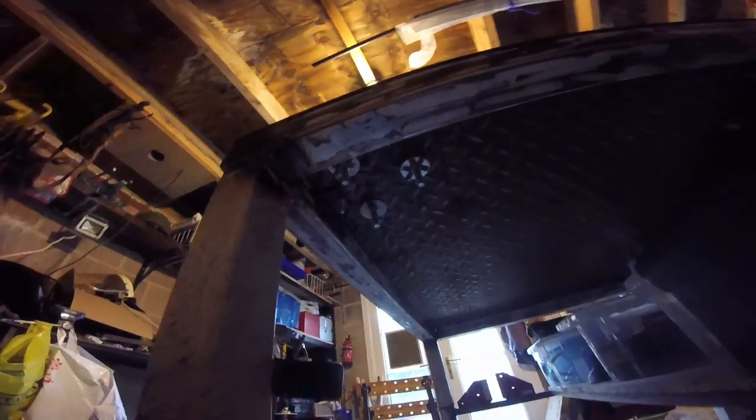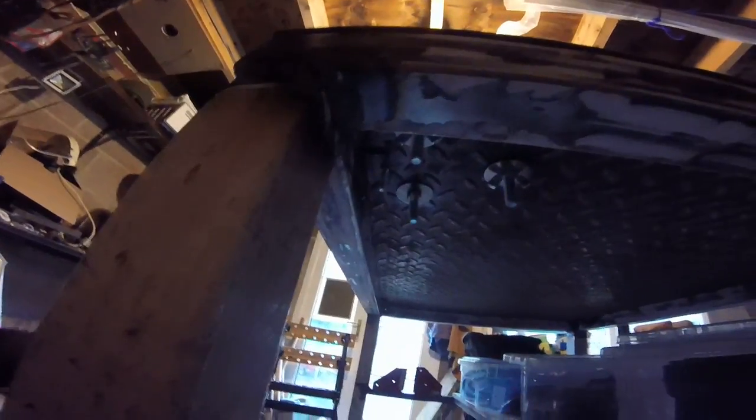There are bits of box steel down there as reinforcements and angle steel as extra enforcement and supports. There's a shelf here, and I've drilled through this top plate and put these big M10 bolts through to mount the vices with wing nuts. You can also see where the top plate is bolted onto these welded brackets which attach it to the underlying chassis.